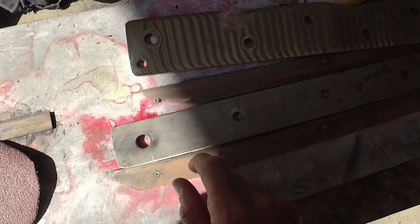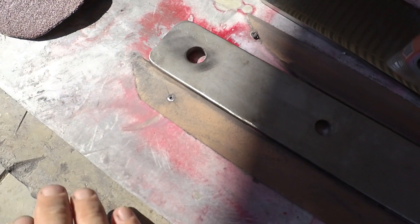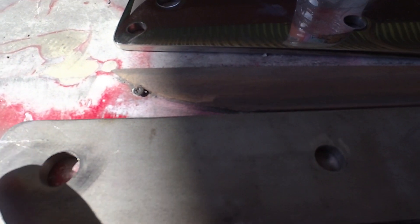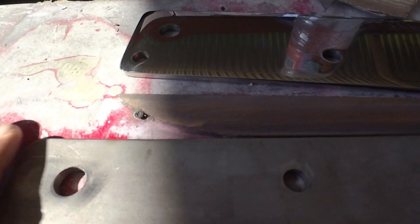They were all cut to size, ordered from onlinemetals.com, and when they arrived I had a machine shop drill all the holes. This is how the raw material looks when I receive it, and it's going to turn into this very mirror-looking finish. But to do that it's a lot of steps — I think I'm going through 14 different steps. I start sanding with 40 grit sandpaper, and that probably takes at least 50% of the total time. I have one more chain plate to polish — totally I will have done 10 when this is done.